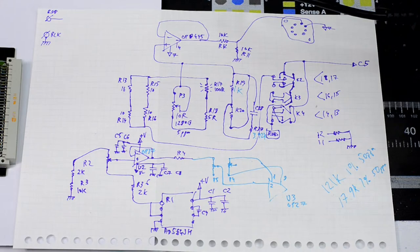And I traced a bunch of other circuits, but they are not really related to all this stuff with the resistors. And then a bunch of relays, K2, K3, K4, just handle the reversal of the current and also the external current connection, if you want to use this bridge with the extender. Together with the extender, MI provides the capability to give currents much higher than what the bridge itself can do. For example, the bridge has capability up to 250 milliamps of current, and with the extenders you can go up to like 10,000 amps, depending on what configuration of extender you have.